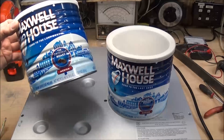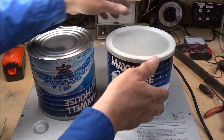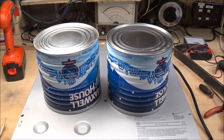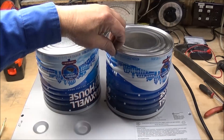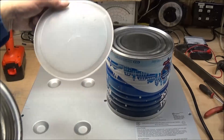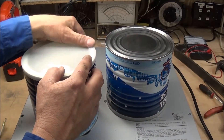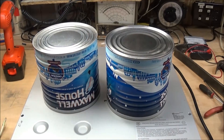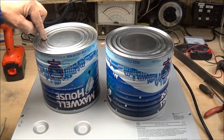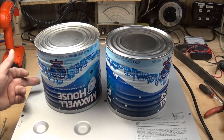I need to go out and find two more of these coffee cans. These will actually be turned upside down - I'm planning on showing you how to build a UHF duplexer out of four coffee cans. The bottom is plastic, so it'll be lined with several layers of aluminum foil and then popped back on upside down. The main capacitor shaft will go right through the middle, then your BNC connector, and we'll put a notch tuning here on the side.